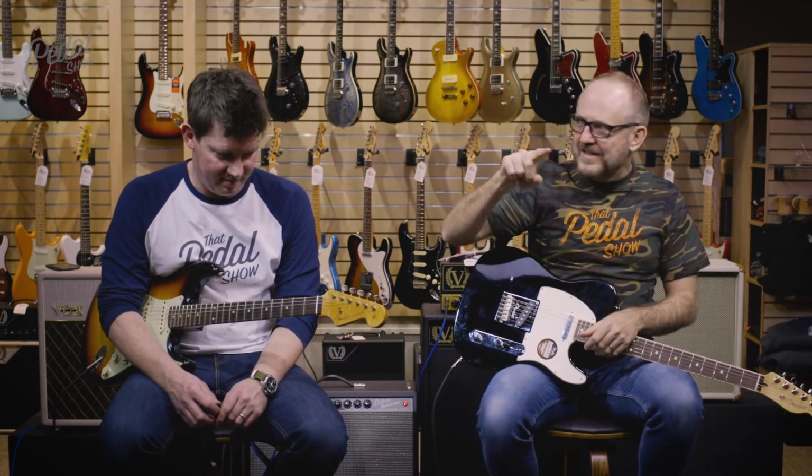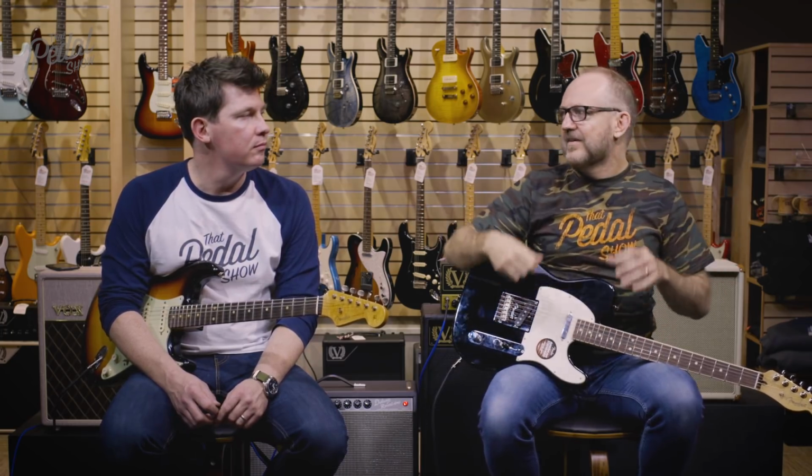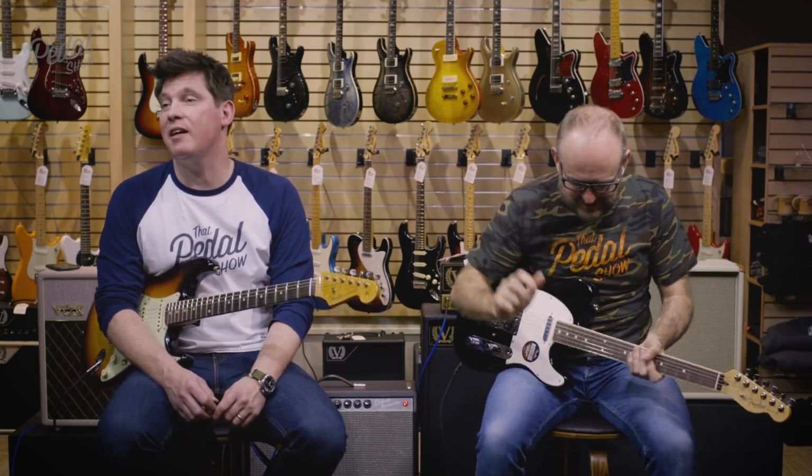We did a show for Boss in London in September, and I brought my old CE1. And we did this wet dry thing, and I put just the sound of the modulated chorus through one amplifier. I turned off the dry amp. And the modulated sound of the CE1 was unreal. There's nothing smooth about it at all. It's really juddery. And if you listen to just the wet sound on all the flangers, they all sound different, which is what gives them their character. So that's how we get flangers and choruses. This is how it works.